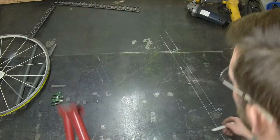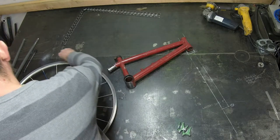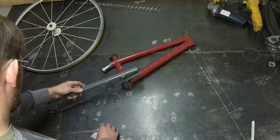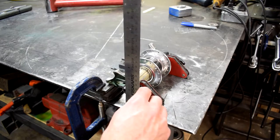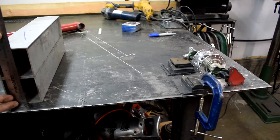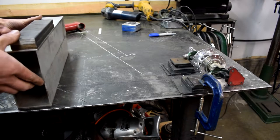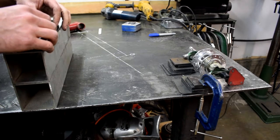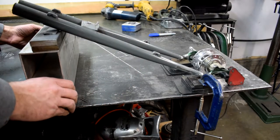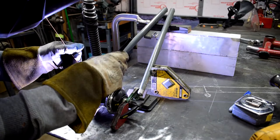Then line up the frame and transfer that over to the table too. A little bit of talc or chalk works fine for marking on the table — I can always erase it later, scrub it out, and move the lines. First, I'm going to set up the track fork ends and get those attached to the chainstays. I've just thrown a dummy hub into the track fork ends — it happens to be an old power tap hub. I figured out the bottom bracket drop, the difference between the rear axle and the bottom bracket of the bike. Using these two 3x3 aluminum blocks, I'll add an extra inch and an eighth to the top. That gives me the difference between the rear axle and the bottom bracket. I've also scribed a center line and am just going to check and make sure that everything is lined up front to back.